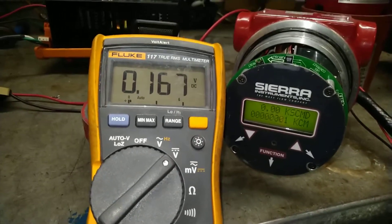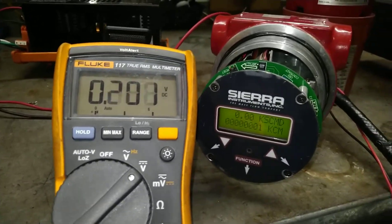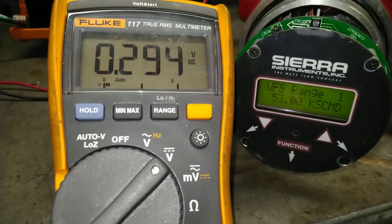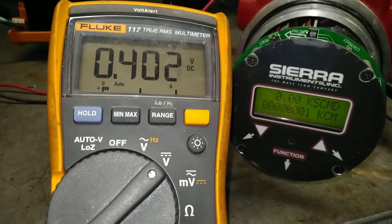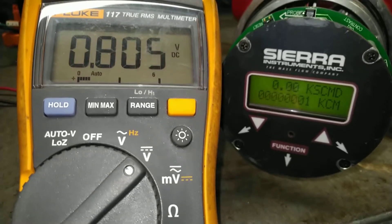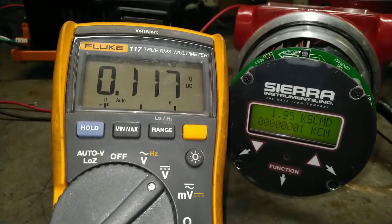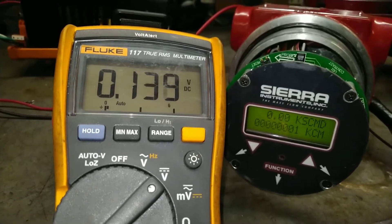We're connected with a voltmeter on pins 13 and 14 for bridge voltage. You can see it starts basically at zero for bridge voltage, then it climbs. You'll see the flow rate — as soon as it gets a little over and hits 12.4 volts, it goes to full rate, and then cycles back to about 0.1 volts.